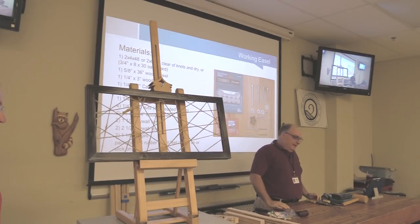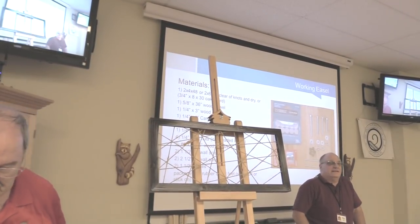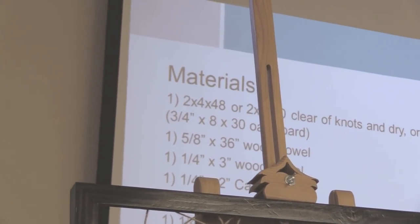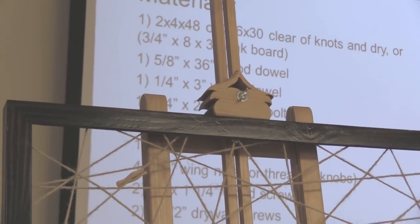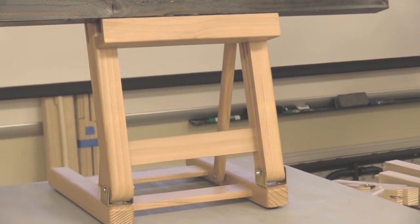Yeah, that is what I did for the 2x4 contest. The picture frame on it is the leftover 2x4, so the actual easel took about 2/3 of it and the picture frame the rest. So that is 95% of a 2x4 minus sawdust and a few scraps. That one I did use the through dados again on my router table. The hinges at the bottom, and I'll pass something around a little bit, were cut out of a piece of tin from a door, just with tin snips, cut off a chunk, an inch and a half, 2 inches, whatever you want, and kind of grind the edges a little bit or sand them to soften them a bit. And then bent them on a tiny little vise I've got, just a screw-on vise for a corner.